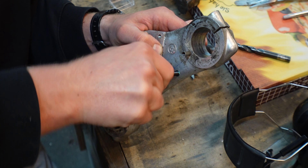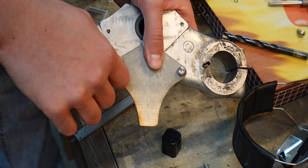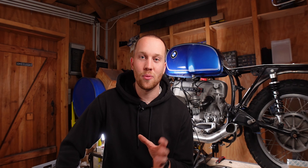With the threads cut, I could go ahead and insert the Helicoil thread inserts, break off the little pins at the bottom, and then screw on the bracket. I was quite relieved when I saw that everything lined up. I now just have to repeat the same process for the third thread and cut a 10mm hole for the headlight.